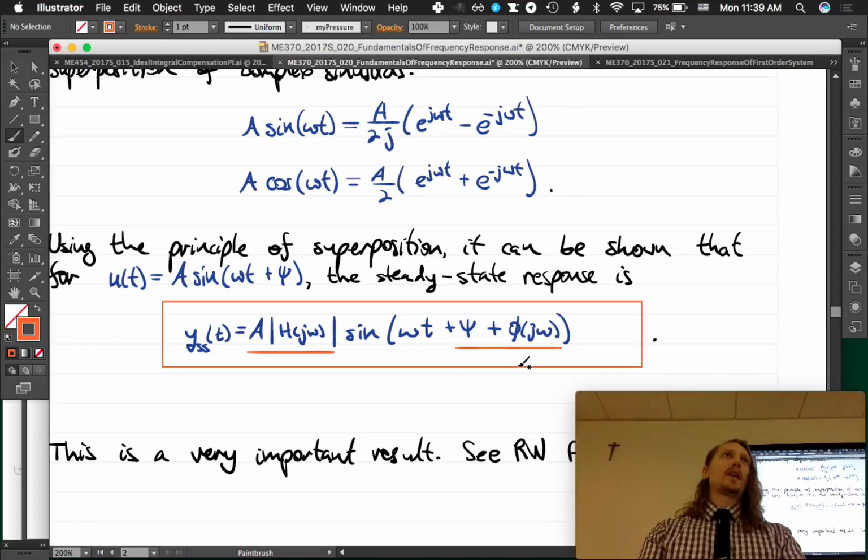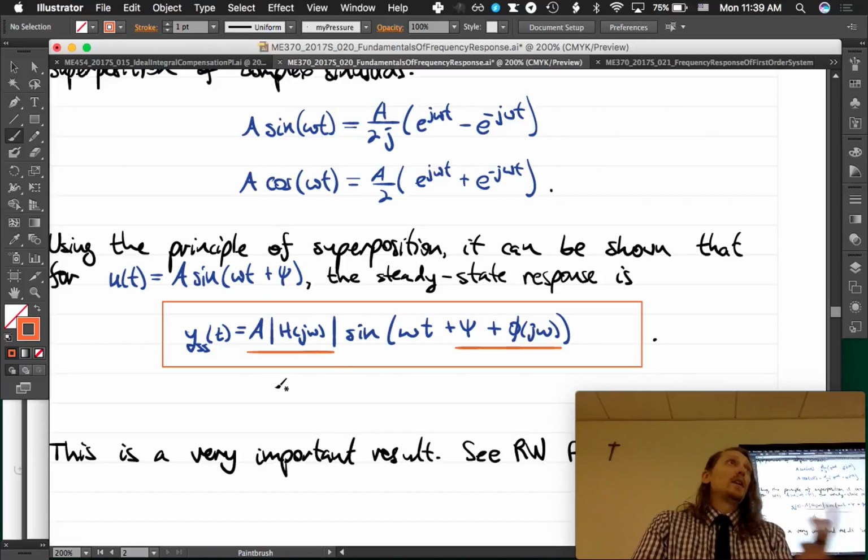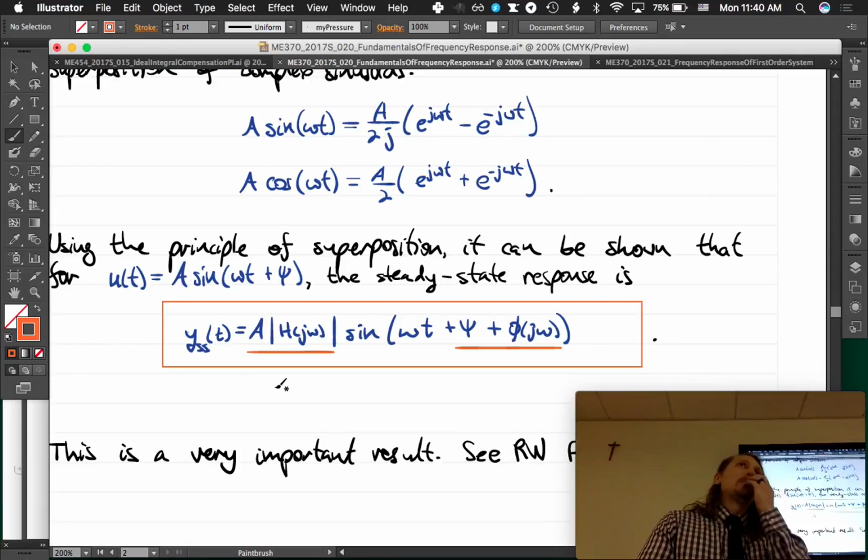And I would say we are often more concerned about the amplitude than the phase, but they're both important to us. The amplitude, I mean, you can imagine how we care about systems that respond to certain frequencies and not others. We really need to know about that. We need to know, okay, you can run this motor at, you know, 7,000 RPM, that's fine, but when you start up, you go through a resonance because we see a peak in the motion of the chassis when you go through, you know, 500 RPM.